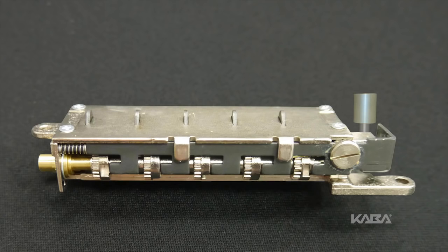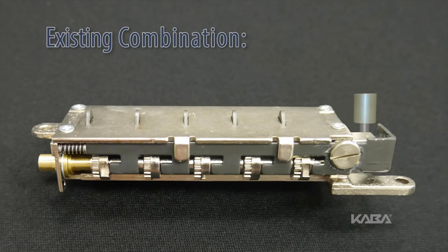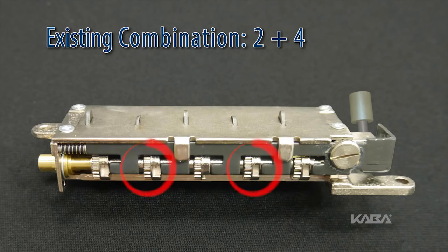This indicates that the current combination uses two different number buttons — for example, two and four — which are depressed at the same time as part of the combination. Using a small flat blade screwdriver, depress the key stem or stems that correspond to the gear pockets which have been rotated the farthest away and are out of alignment from the L-shaped leg. When depressed, the key stem or stems should stay down and the corresponding gear pocket or pockets should move closer to its corresponding L-leg or closer to alignment.